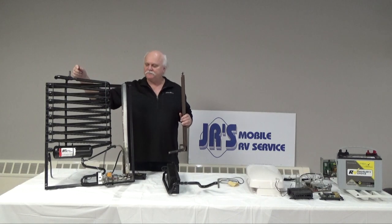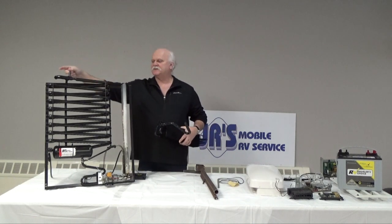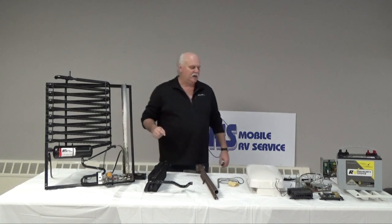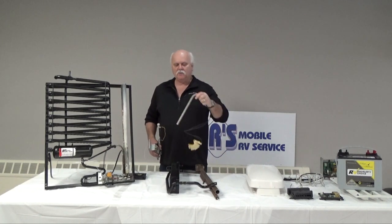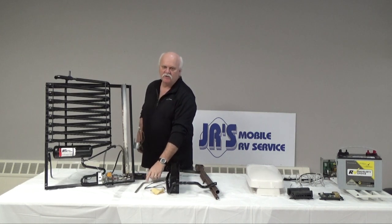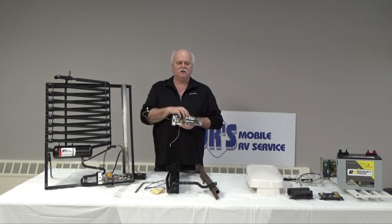With the ammonia, when it's running up here through the top, other than where I've sectioned a piece out, there is another internal pipe. So the ammonia keeps cycling itself back through there as well. Again, in order for that to happen, we need two sources of heat, and one is the electric element, most common. An RV absorption fridge's first choice is always 110 hydro, and the second source of heat would be the gas or the propane end of things.